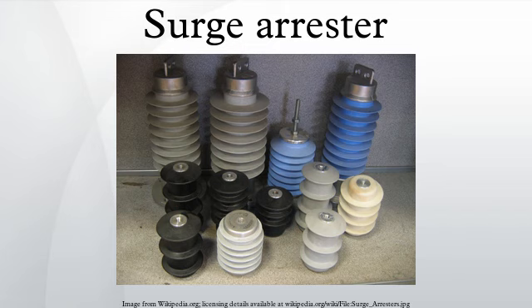Without very thick insulation, which is generally cost prohibitive, most conductors running more than a minimal distance — say greater than about 50 feet — will experience lightning-induced transients at some time during use. Because the transient is usually initiated at some point between the two ends of the conductor, most applications install a surge arrestor just before the conductor lands in each piece of equipment to be protected. Each conductor must be protected, as each will have its own transient induced, and each SPD must provide a pathway to earth to safely divert the transient away from the protected component.